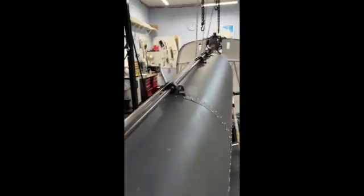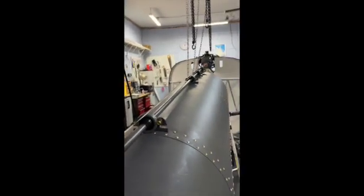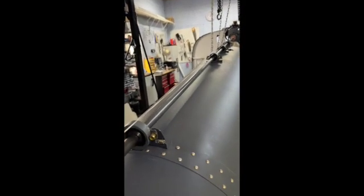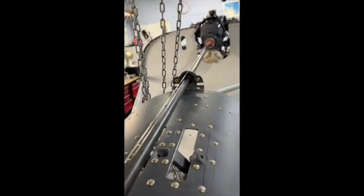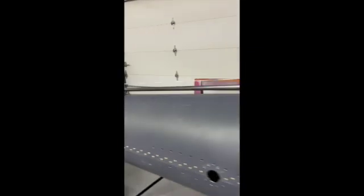On the control surface — in this case, if you've ever used a long 12-inch drill and drilled off at an angle, that drill will get hot where you've got it bent and it can eventually fail. So this is why you want to be careful and make certain this drive shaft is lined up. There's actually no spec for it in the construction manual or in any of the maintenance manuals from Sikorsky, but it's one of those things — let's just make it as straight as possible and we should be okay.